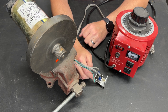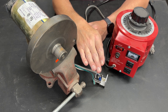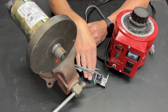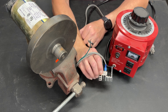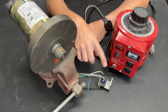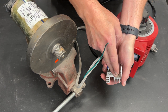Because the demands on this motor are going to be way less, I choose to use this bridge rectifier for demonstrations because it's easy to hook up — these are very simple spade terminals. The bigger unit actually requires being soldered on and a better connection. So for demonstration purposes only, with no load on the motor, this bridge rectifier is sufficient, but I never recommend using it for your actual install. Heat is the biggest thing that kills bridge rectifiers, and even for demonstration purposes I still have this connected to a very stout heat sink to help keep it cool.